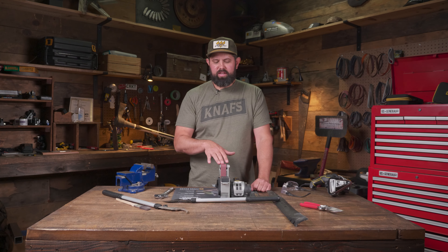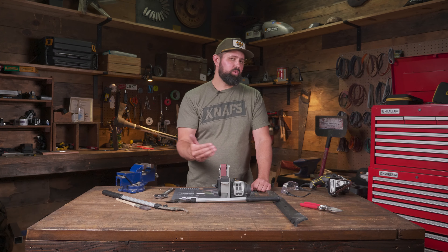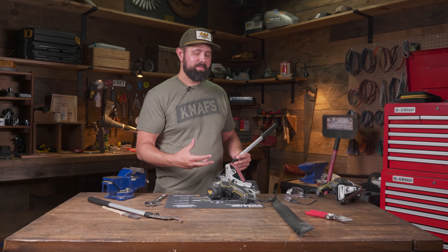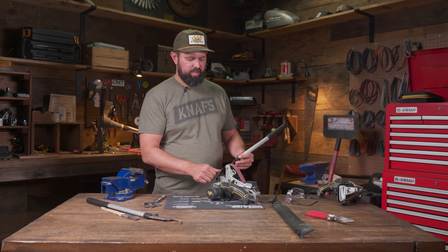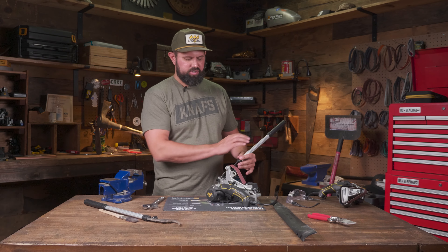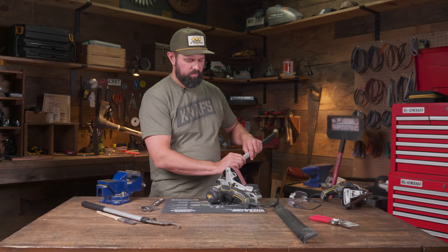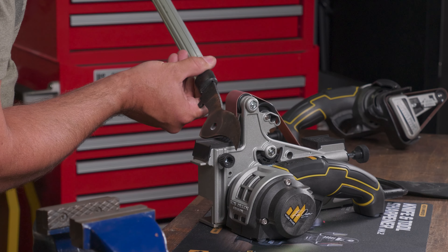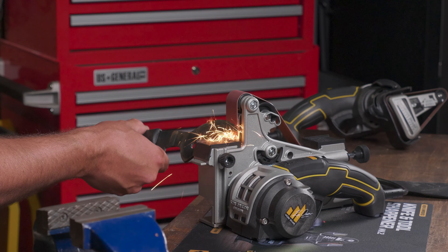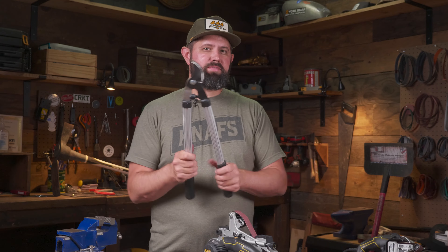Let's jump over and show you how to sharpen these loppers on the blade grinding attachment. In most cases you can sharpen in between the two pulleys like any other tool; however, these loppers have a unique geometry so I'm actually going to use the front platen. Using the front platen can involve a little extra setup — I'm on the opposite side of the machine and I need to match the existing bevel, laying it up against that plate to make sure I've got it even. Also make sure as you make that pass across the edge you've got room for the handle to go down below the edge of the table.